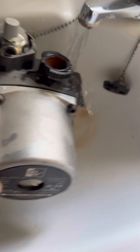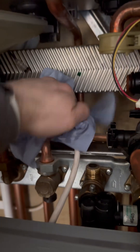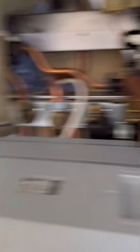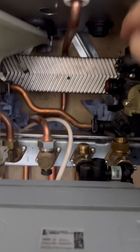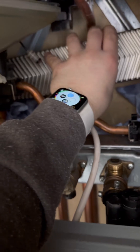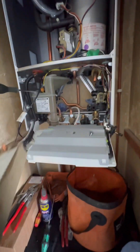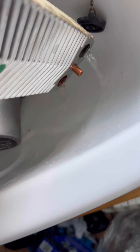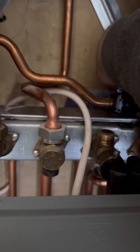Another reason I like taking the pump unit out is you can give it a wash — look at the state of that. This system probably isn't the cleanest. Scrunch up some blue roll and put it both sides of the plate, because when you maneuver the plate out there's going to be some water that comes out no matter how much you've drained it. That return pipe you want to twist it all the way around to move it out the way — you'll see why in a bit. Undo the two securing screws. Once they're undone you can do this one-handed: drop the left hand side down, the right hand side up, and then it will literally just twist and maneuver out — turn it so you don't drip on the PCB. I don't do I-told-you-so's, but if I did — there you go. Blue roll is wet.